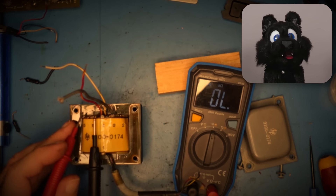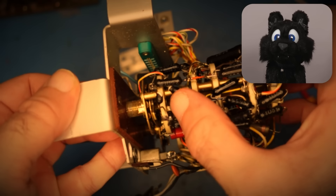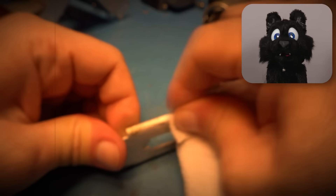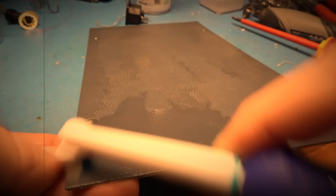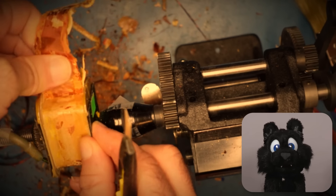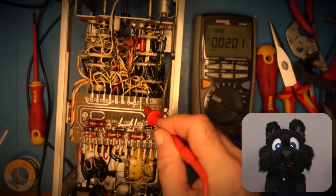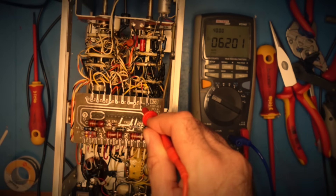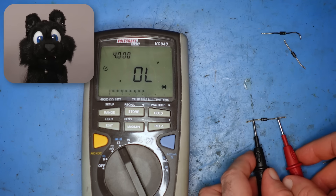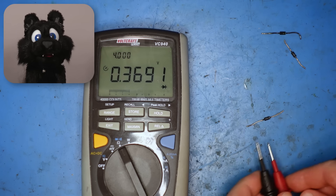A quick recap. The power transformer had both primary windings and at least one secondary shot, a resistor was broken in two, and the whole thing was quite dirty. Mark did quite a bit of cleaning on his side already, so I had to only brush up the parts that were inaccessible when assembled. Cleaning the case and replacing the filter caps was simple enough, but the transformer took an extra round this time — somehow I managed to short out the winding against the shielding layer. Overall the power supply was working when I finished part one. A comment on the first part mentioned that maybe a rectifier diode was broken and caused the transformer to burn out, and indeed one of the old ones is just a dead short. This might be the root cause of the problems.